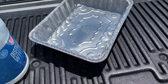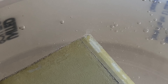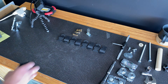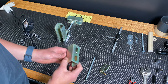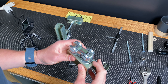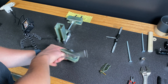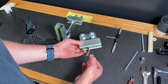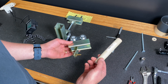Now I'm going to focus on the assembly of the trolley. First, I'm going to attach that short section of strut — with the hole down the center — on the bottom with the U-facing downward, using two bolts to attach it. If you use a quarter-20 bolt, the hex head will be retained in the trolley without spinning. Next, I'm going to insert the strut pipe clamp into this channel, which will hold the one-inch pipe going across the ceiling. For this mock-up I'm using a short piece of dowel, but in the final assembly this will be an eight-foot-long piece of metal pipe.